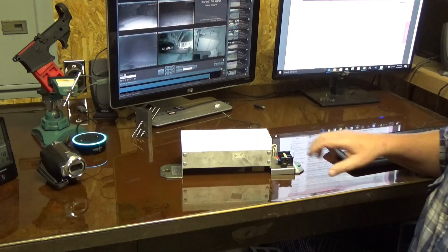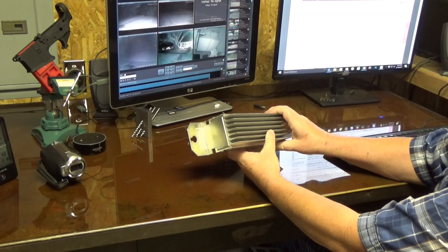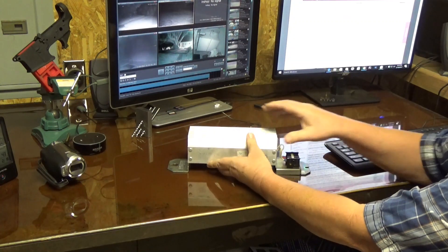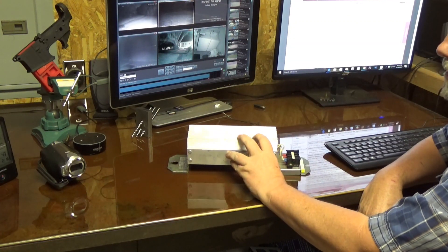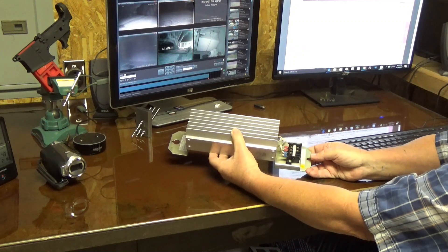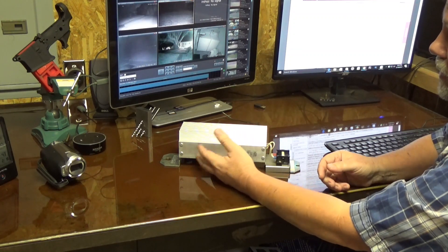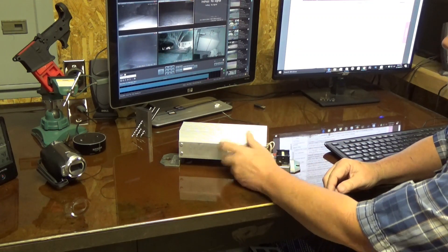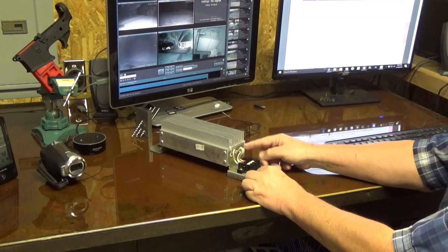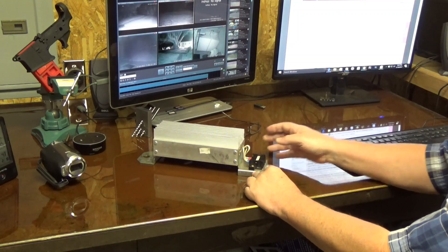What I've got here is a big resistor — the Fuji DB 2.2-2. When the motor spins down, AC induction three-phase motors basically become a generator. If you want to use that energy for braking, you've got to dump it to a resistor in the form of heat. Inside here is basically a heater coil out of a resistive heater. It also has connectors for a thermistor to detect overheat conditions and shut the VFD off.